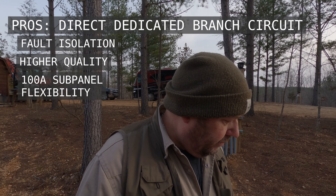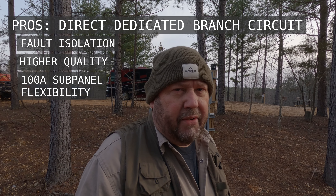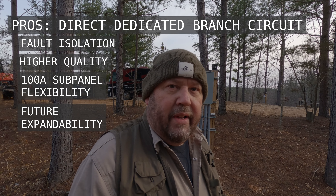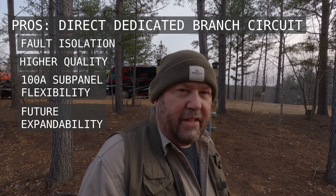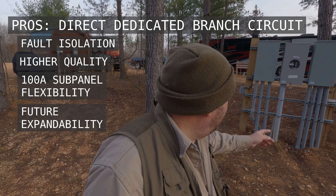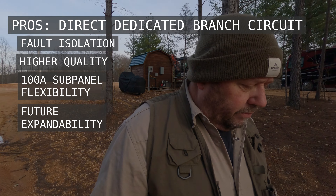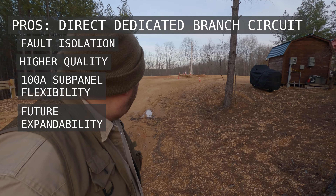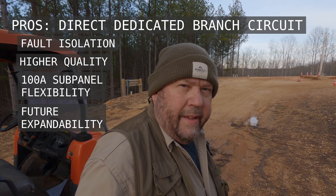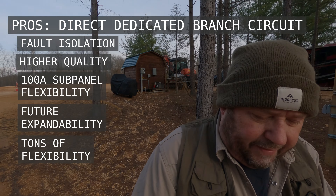That's one of the really cool benefits of doing a dedicated branch circuit directly connected to the RV temporary panels. All these pros give you a lot of flexibility with your electrical infrastructure for the future — you can add hot tubs, casitas, EV level two charge stations. There's a ton of flexibility when it comes to metering the power. I can meter at the distribution panel, I can meter there, or I can meter at the RV pedestal. If I meter at the RV spot, I can decide to rebill my customers for their RV power, and I could bill separately for an EV charging station at their pedestal as well.